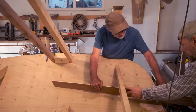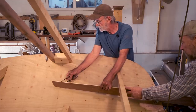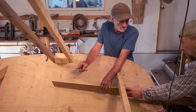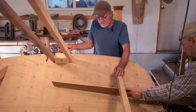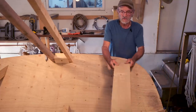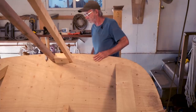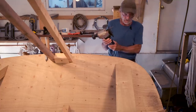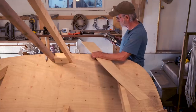This is the edge of the transom right here, just approximately, and that's the center line right there, so we can put it back in relative position after we cut it. I'm going to transfer that line up here, and this one's going to have to be transferred up here too. So what we're going to do is take this, put it right up here, and I'm not going to go over to a woodworking bench or anything like that — I'm going to cut it right here on the scene, then trim it up and fit it.